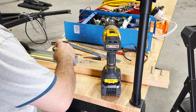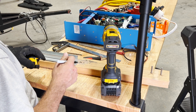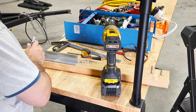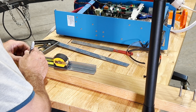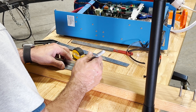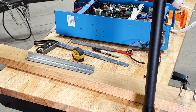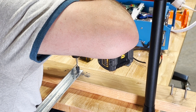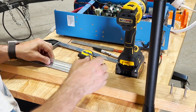With the pieces cut to size, it's time to drill the screw holes. I started with the side bars, since they're the easiest. I placed a screw three-quarters of an inch (about 2 centimeters) from each end and one in the middle — three screws are plenty since the side pieces just keep the batteries from sliding and don't support weight. The end bars support the straps, so a couple of additional screws are needed. I placed strap screws at 2¼ inches (5.7 cm) and 6¼ inches (15.8 cm) from the strap end. I then cut a countersink into the bar using a conventional countersink bit and handheld drill so the screw heads sit flush with the bar surface.